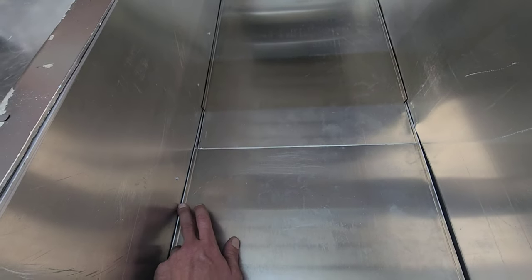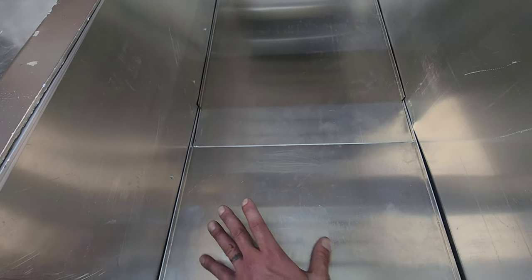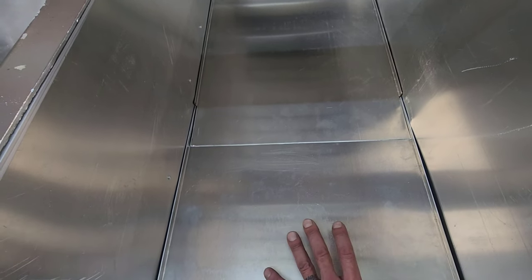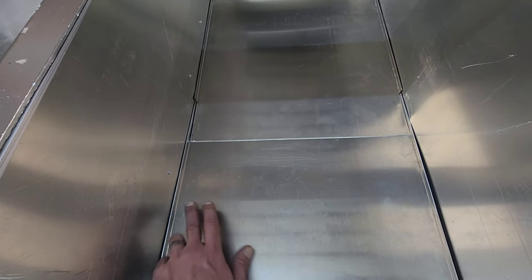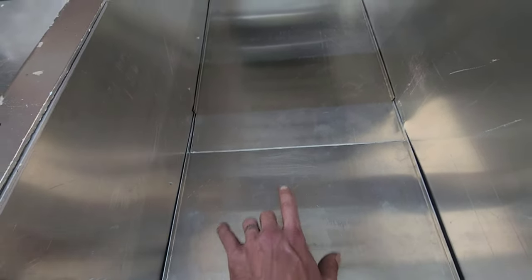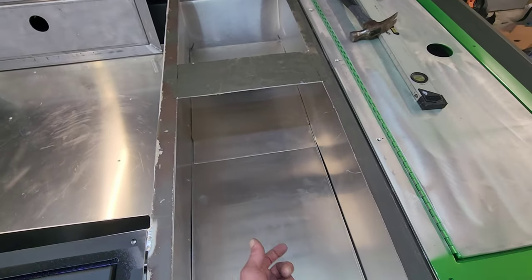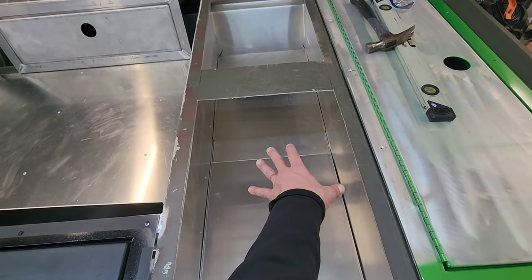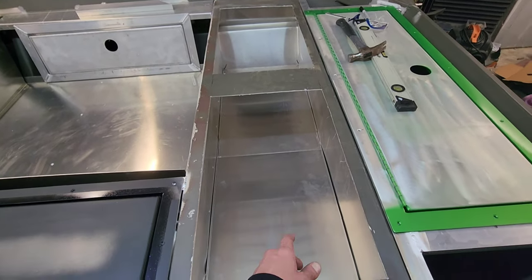I would normally make this piece bigger, but I was only allowed a 3/8-inch lip with an 18-inch piece because this back bench seat is about 17 and 3/16 inches wide. It's going to be tight — I'm going to have to shoot these rivets perfectly. I'll take this piece out and pre-drill holes on either side so it's easier to get under my drill and rivet gun. I've got to get this thing in and installed, then put his battery tray in the center. Let me pre-drill them the best I can, put them back in the boat, get it installed, and move on to the next step.